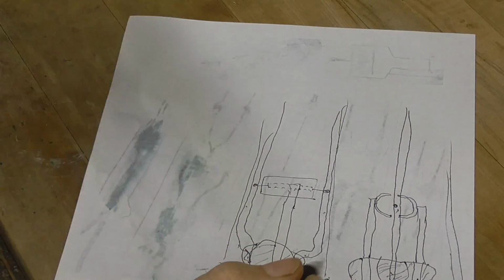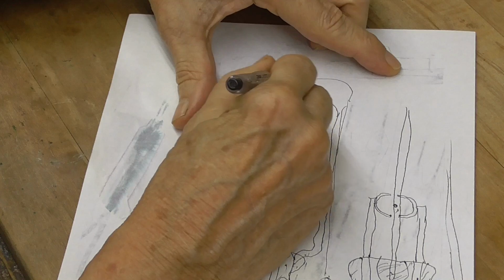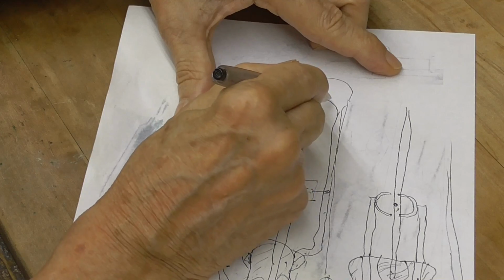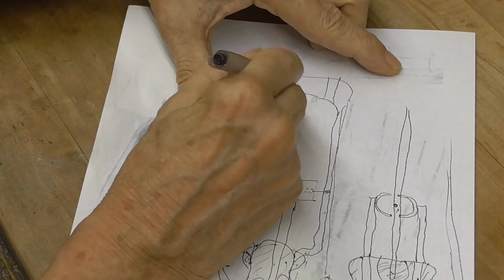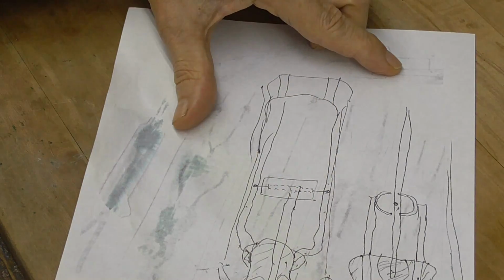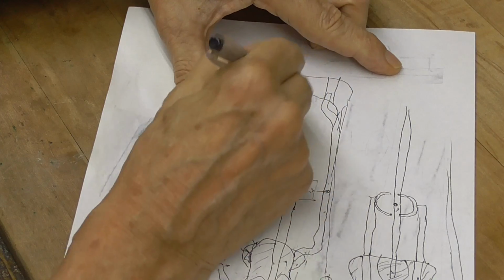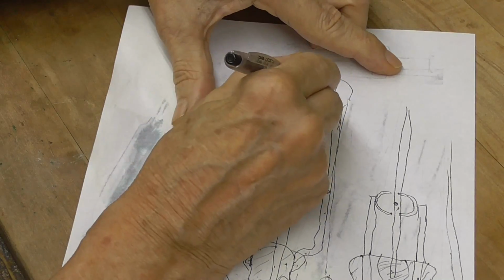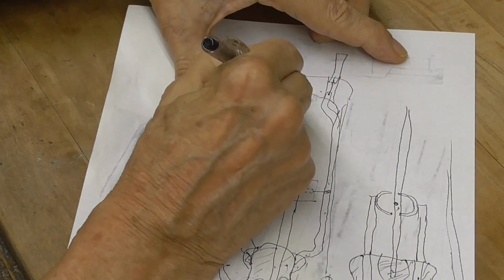Now, when we do the other end of the tube, what we'll do is we'll have a pinch seal. This will be the tube that's coming back down to seal it. And what we'll do is we'll make the pinch seal have two tunnels in it. Okay, we do that by using some carbon. And we take these wires here, and when we put that together, we'll arrange them to go up into that pinch, like that. And then we'll have our tungsten seal, and then our electrodes coming out the end for the filament.